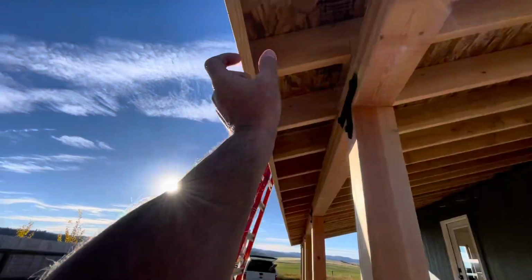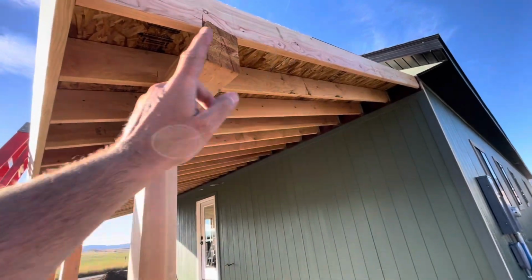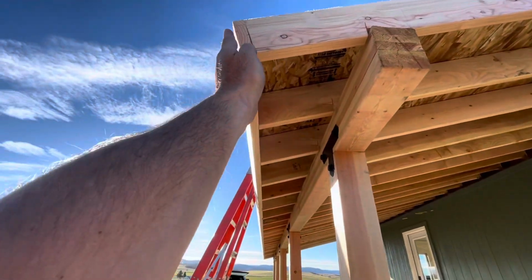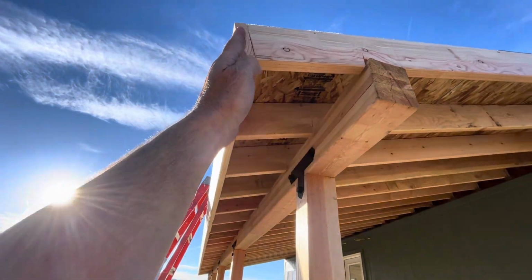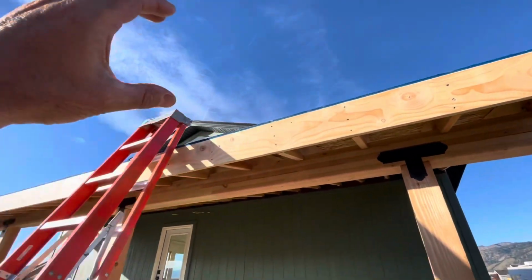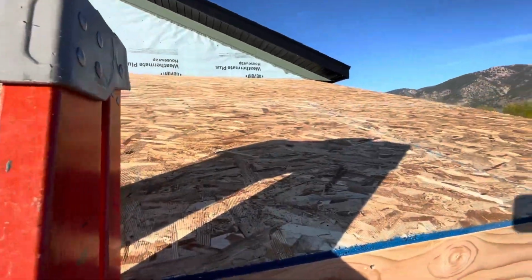And then we set a chalk line and trimmed all of these off to allow for, we measured our metal roofing that's in 12-foot strips, and we got it all dialed in so that it'll sit just slightly off of the house and have a 1/2 inch overhang. And then we trimmed all those off one at a time with the handsaw, and then we put this fascia on, and then we screwed in some brace boards, and then we started throwing sheets up there, and we sheeted it.